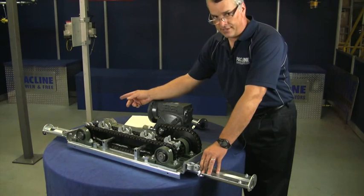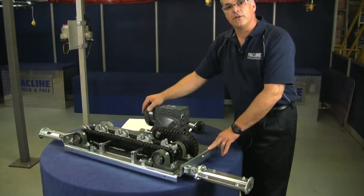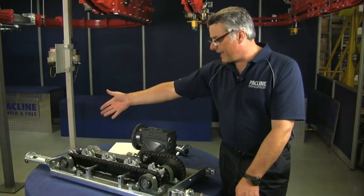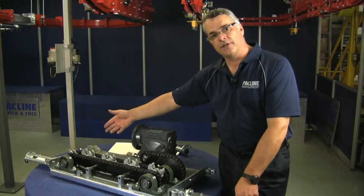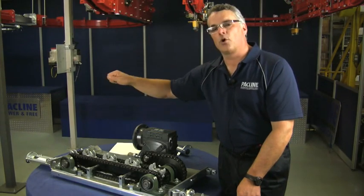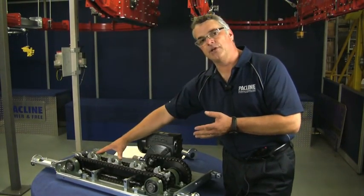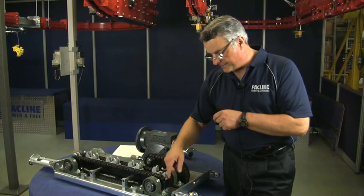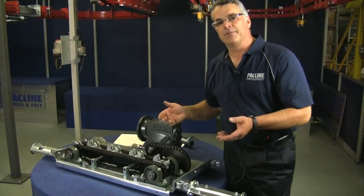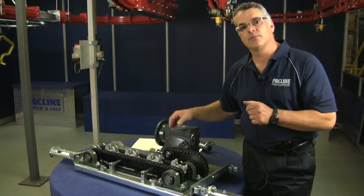On the opposite side, it has the lowest tension in the whole system. So obviously we put our take-up unit on the output side of the drive unit, because it doesn't have to work as hard to pull the chain slack out. If the chain slack is stuck in the track just down from the drive unit, these dogs will not disengage from the chain properly and they'll try to push it forward. That will eventually cause noises and a jam of the caterpillar chain unit. When your drive finally gives up and jams, those hold-down plates on each side will be bent — and that'll be the evidence you need to decide what's happened.